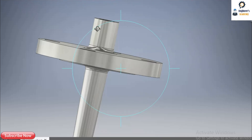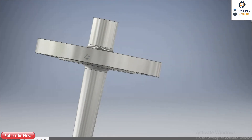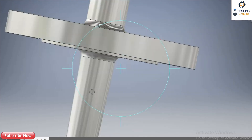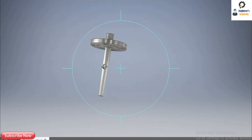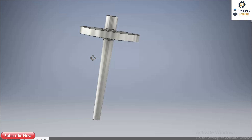This distance is the head of the thermowell, which is 50 mm — and that includes the flange thickness. This is the thermowell with a flange process connection and tapered shank. This particular length is known as the immersion length, which is the length that goes inside the process and comes in contact with the fluid.